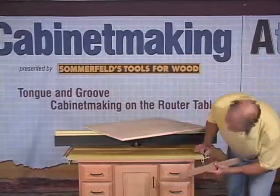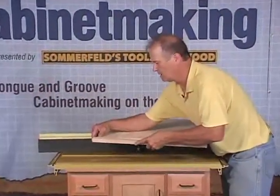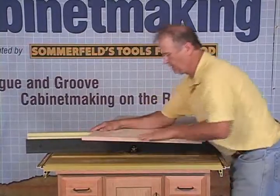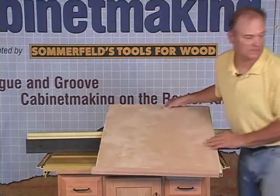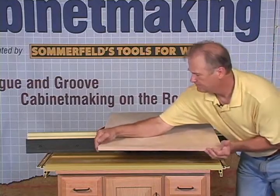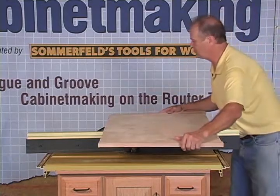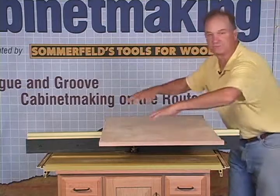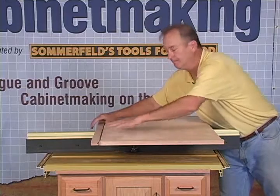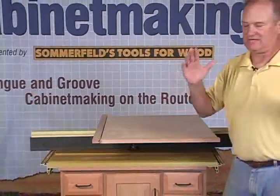Now, all we have left to do is take our edge banding. Okay, you can see this is the top side, how we're nice and flush right there. What we want to do is line this up, front and back. And what I do first is I'll clamp these two edges on first. Clamp this on after that's dry. Come in here and clamp this on out here. Then you can take and size after that's all clamped up. You can take and cut that to the exact size.